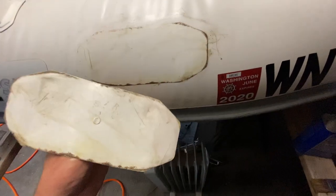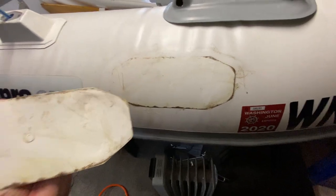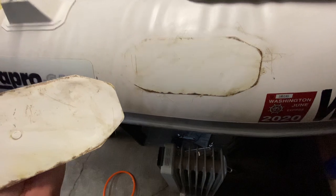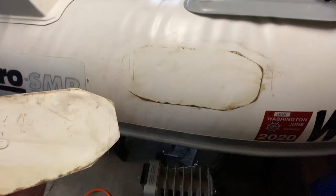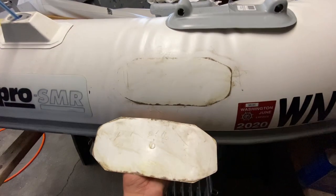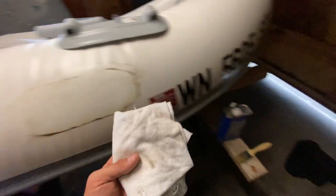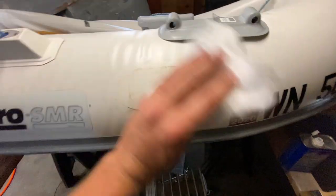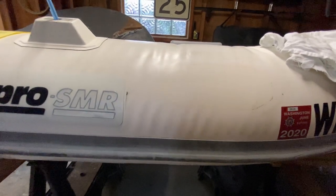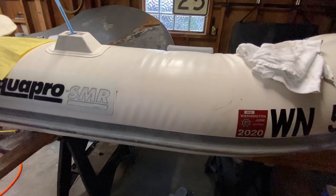I got the handle off. I have to note that removing stuff from PVC is significantly easier than removing stuff from hypalon. In my other video I tried for like an hour to get a small Weaver davit pad off, but this method worked really good. To clean up the dirt ring and the excess glue, get a rag, put some acetone on it, and wipe it all down. I got this spot cleaned up as good as it's going to get, so now I'm ready to fit up the pad and mask off the new area.